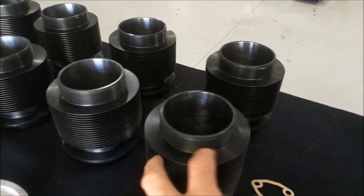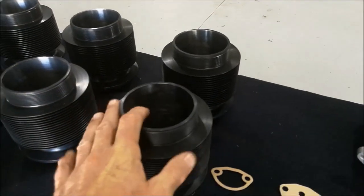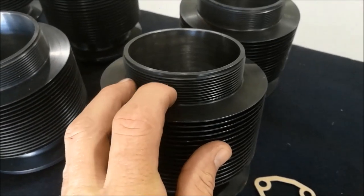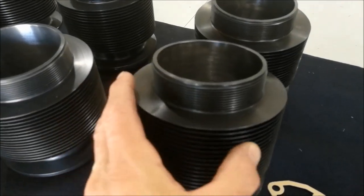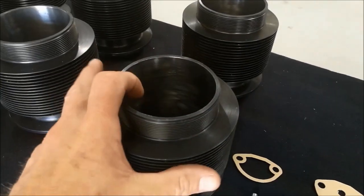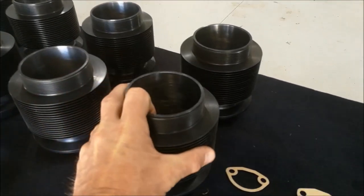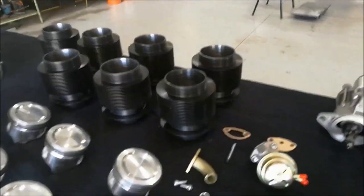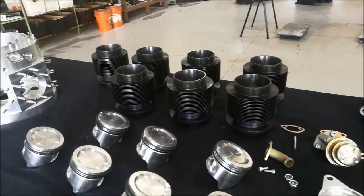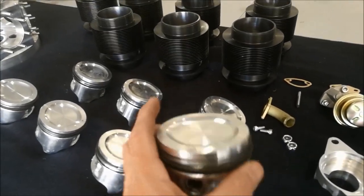Starter motor. The classic cylinder is used on both the 2800 and 3600 — not honed yet but ready for honing. The cylinder head is screwed down onto a 2-millimeter pitch by 89-millimeter custom thread, and the head gets screwed down tight under temperature. When the head finds its resting place, the cylinder base holes are drilled to match the alignment of the head — there's no way to pre-drill them and expect alignment. The standard piston is a Toyota piston we've been using since day one, with no problems.